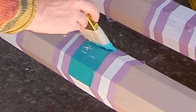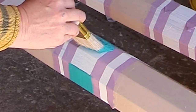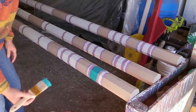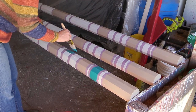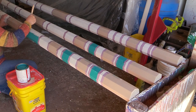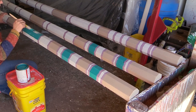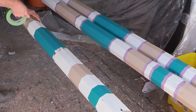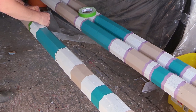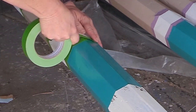I really like the brightness of the turquoise and I couldn't find turquoise in Rust-Oleum paint, so I actually went to Sherwin-Williams and bought a quart of their oil-based enamel paint in a satin finish, because it was a little more affordable than the high gloss finish. Once the tan and the turquoise were dry, I removed the original tape and then put on more tape because I'm going to be doing another color. Some of this worked really well because I could just put the tape on the edge of the previously painted color, which makes it a lot easier to get nice crisp lines.